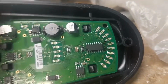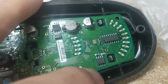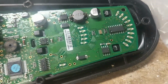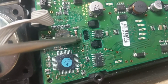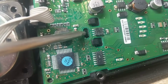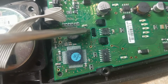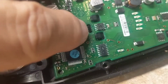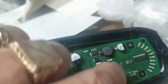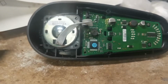And the way we're going to do that is, I'm looking carefully here. Okay, I do see 2 tabs, one there and one there. And then we have a tab right here in the middle. Can you see that right there? Okay. Now, I've done this before on another video of how to clean the contacts. So if you want to refer to that, I'll put a link in the description below. But what you're going to do is press down on that tab and slide the circuit board towards the joystick. I'm going to do that now.